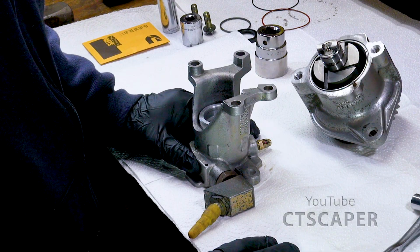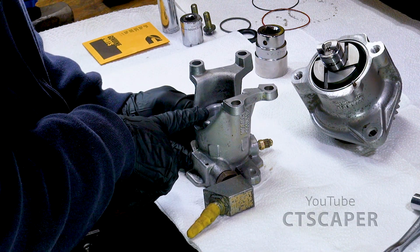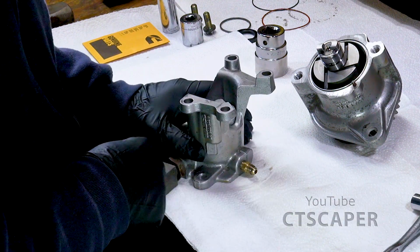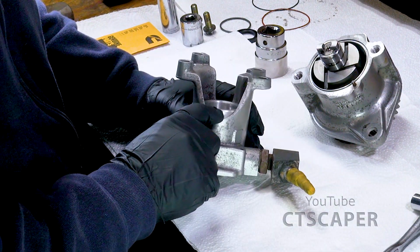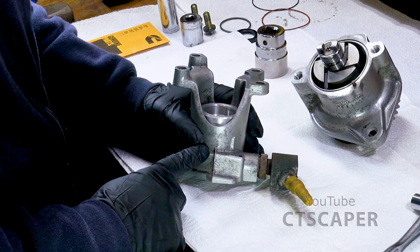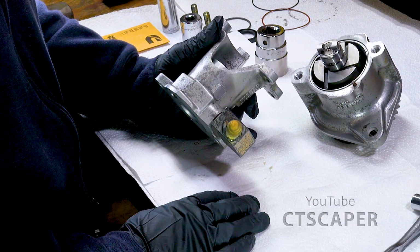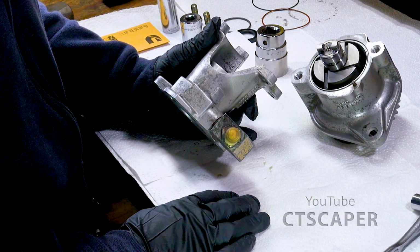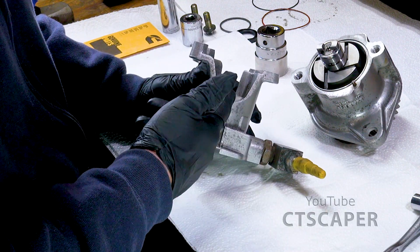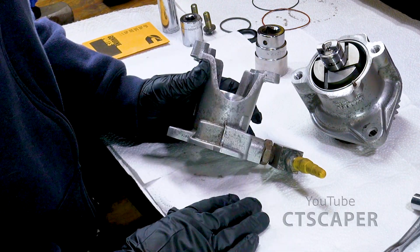Okay guys, well I just went in and watched that last clip of me driving this in, and it was pretty painful to watch. After I banged it the first time, the seal pretty much sat. Maybe I could have gone back one more time and checked it, but I definitely hit it too much. If you can learn a lesson from me, when you're driving a seal like this, when it stops going, don't keep hitting it.